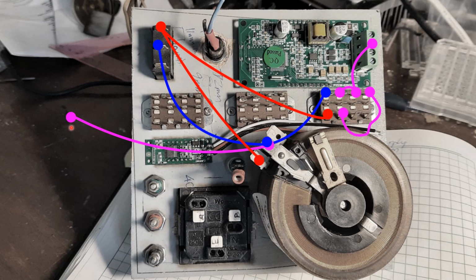So for example, this is in a way the live switch output. This is neutral. So the neutral connects to one of the variable transformers, the bottom part in my initial circuit diagram. The live connects to the top part, which is wrong here. I just discovered it's wrong. Anyway, ignoring some of the things, I had lots of these diagrams to figure out what I was doing, and I only see I made a mistake here, but when wiring it, I think it was correct.